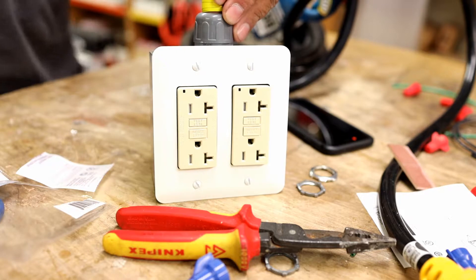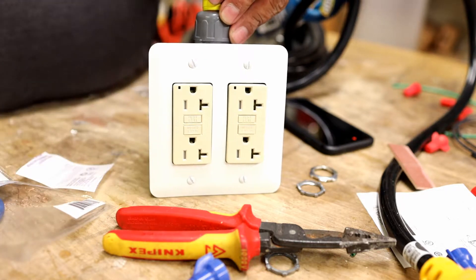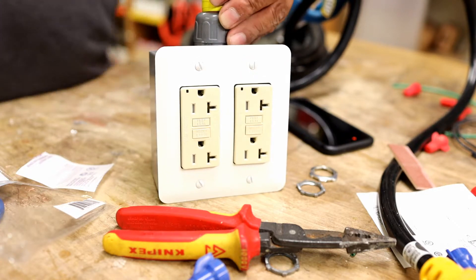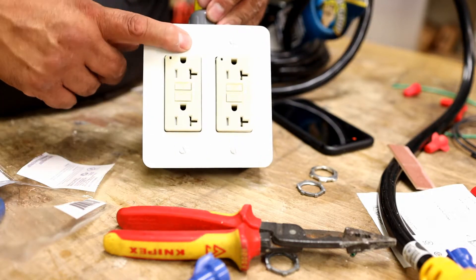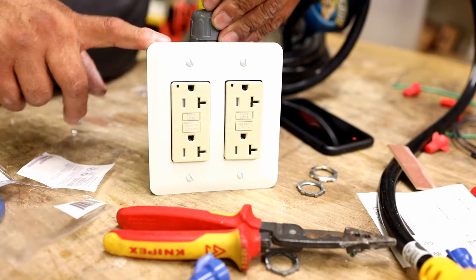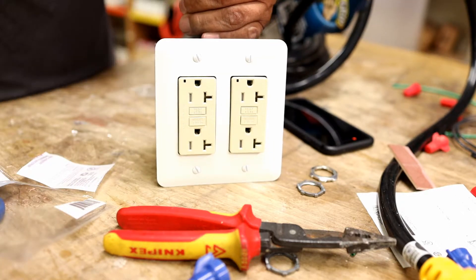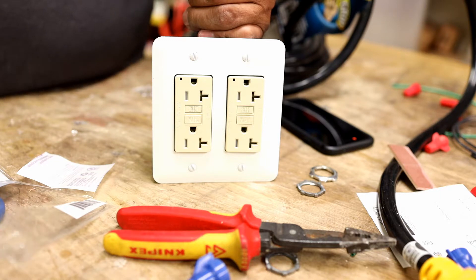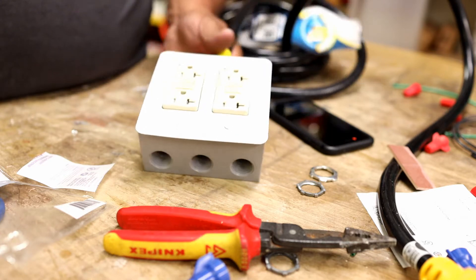Before I end the video — when I have power I can take my GFCI outlet tester, put it in there, and make sure everything is reading good. My main concern is the ground. There's a ground on the generator and these outlet tabs are grounded, but I need to find a way to ground this box or ground the generator outside. If I could run a ground through the piping in the house or into a service panel that would be better.